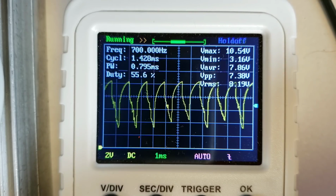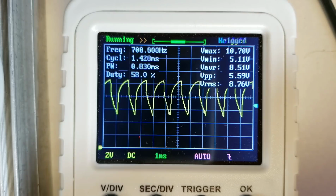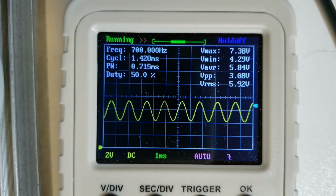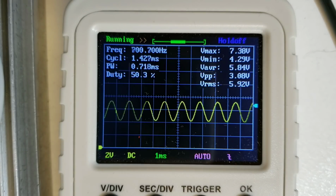By this time you'd be completely deaf, so it's not really a situation you ever encounter in practice on the air. You'll be within the linear behavior of the op-amp when you're using the radio in practice, otherwise you'll be deafening yourself. The use of an op-amp for the final audio amp stage was just an economy to try to streamline the design and the costs of the project.